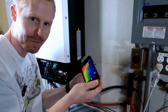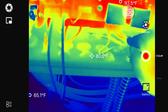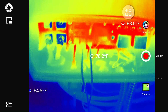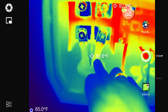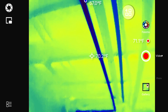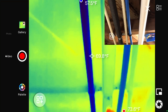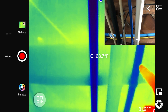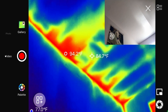This tiny device gives me the ability to look around and see if I have any hot spots, or a loose connection that's building up heat and needs to be tightened down. Over time certain connections can come loose, heat up, and cause you to lose efficiency — and if it gets too hot you can have serious problems. You can also use this for plumbing: here's my insulated water pipe — is it showing heat because it's missing insulation? The cold water lines look good. And you can use this to check if you're missing insulation in your walls. It looks like I actually am.